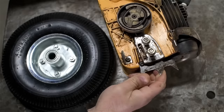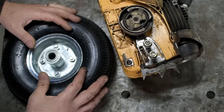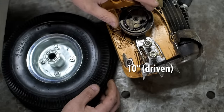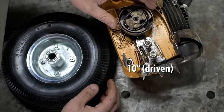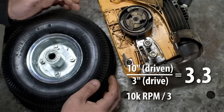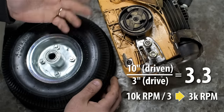My first inclination was to add a chain, like a low gear on a bicycle. If we do some quick math: the largest sprocket I could get on the tire is about 10 inches, and the largest sprocket I could get on the saw and still clear the chain is maybe 3 inches. So 10 divided by 3 is 3 and a third — that would drop the axle RPM from 10,000 to 3,000, which is still too fast and only nets me about 3 times the torque on the ground. I need a bigger gear reduction.